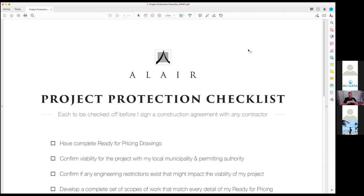Here in Arlington, we have several different styles of houses. There is a whole slew of houses that are built in the 40s and 50s and into the 60s that are all brick and block. So those are relatively predictable homes. Those are what you see in your colonials and your ranch styles, some of your capes. A lot of those houses, because they're brick and block, have no insulation in the exterior walls besides what the CMU block provides. And then there's a little bit of furring strips on the inside walls, and then some nice thick plaster. And so that is your insulation quality in those homes.